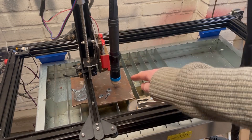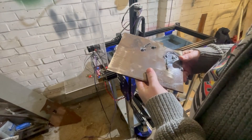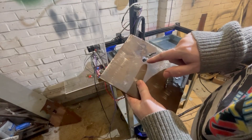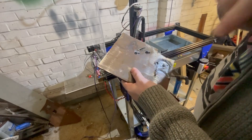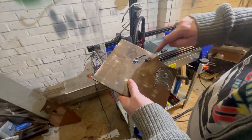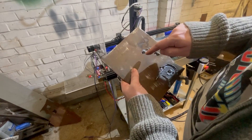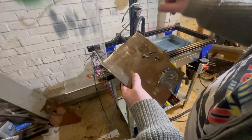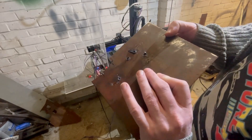More experimenting - it does cut five mil, that's the thing. Morning after the night before: I'm getting some nice cuts at the top here. The holes seem okay on one side but not the other. In Fusion 360 the G-code does a little lead-in wherever it starts to cut - it starts off the cutting area first then comes onto it, so with holes it starts in the middle then comes around and does the outside. Basically you start and stop never on the workpiece itself - like scissors, you come in from the side. A bit of slag on the bottom but yeah.